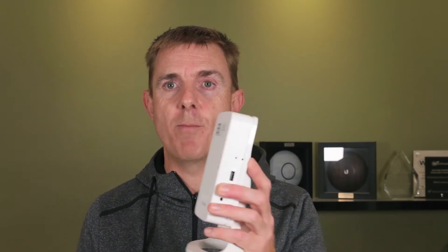This desktop model here is a 2x2 access point, a 2x2 Wave 2. What does that mean? Two antennas, two spatial streams. What does Wave 2 do? Wave 2 gives us beamforming. Beamforming is the ability for this access point to have an idea of where the other connecting devices are around it and focus the RF signal when it's time to talk to that device. Therefore in theory it should give better connectivity and therefore better throughput.